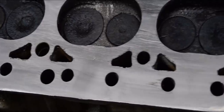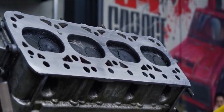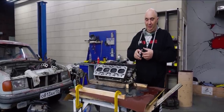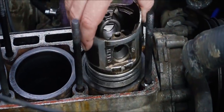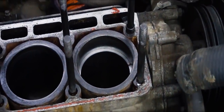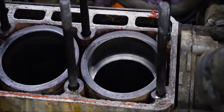So here's the situation, fellas. While that wonderful machine of ours was running and resurfacing the cylinder head, we replaced the sandpaper with a finer grain to smoothen out the surface, and we are looking good. While it was running, we machined us some piston rings using essentially a few blanks as the raw material. We couldn't find the appropriately sized pipe, but we do have metal, and we machined these from a whole chunk of it. They seem to be a pretty good fit for the cylinders — place it in there, press it down with a piston. Those clearances are excellent, it's all good. I do see some sort of gaps in there but I do think those will wear away and the whole thing is gonna work. Let's assemble the complete engine and try firing it up.